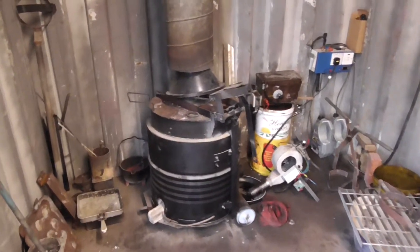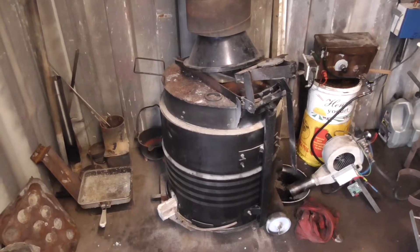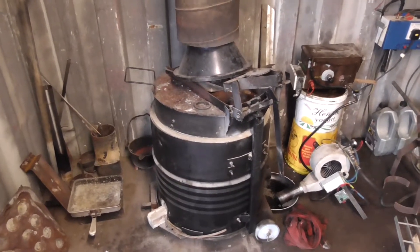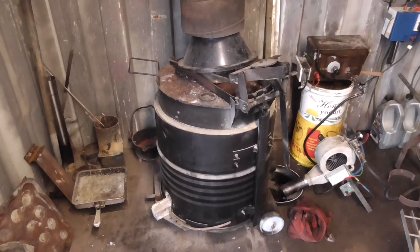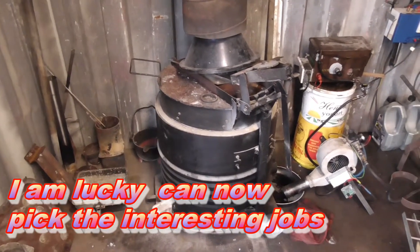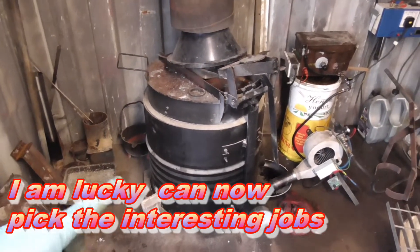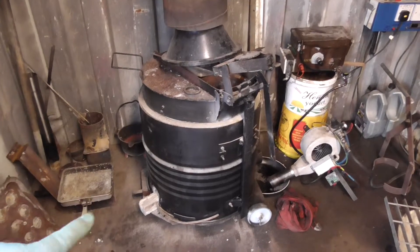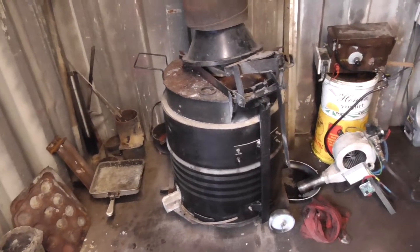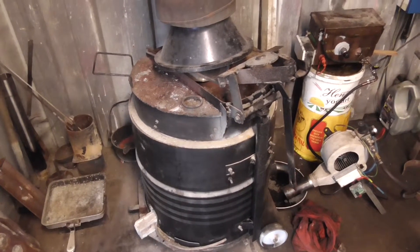So the furnace - I built this about four, maybe five years ago. I'd already been doing casting, but I built this specifically for my home use, just in case I ever decided to go commercial myself. And to be fair, I don't think I'm ever going to do that now. It was a high temperature refractory - can't remember the temperature now - but it's more than capable of handling cast iron temperatures. It was a commercial grade refractory, cast with stainless steel needles, all high bonded.